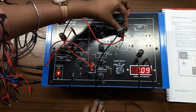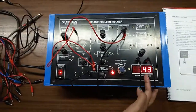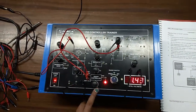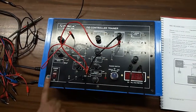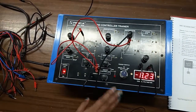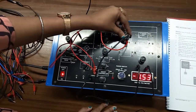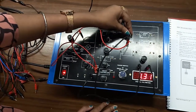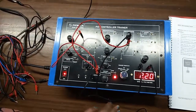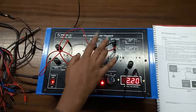Our set voltage is approximately 1 volt and we can see that around 1.43 volts the LED is glowing. This means the differential gap is less when the knob is at minimum position. Now turn off the kit, set this knob at maximum position, and again vary the disturbance knob to observe the voltage at which the LED starts to glow. As we can see, when the knob is at maximum position the gap between on and off is also increased.